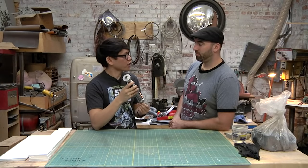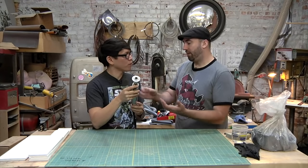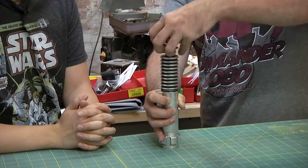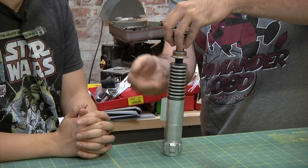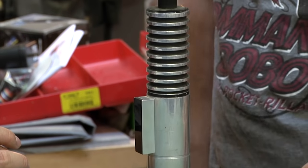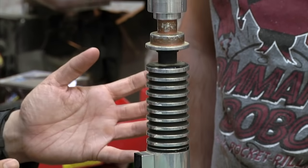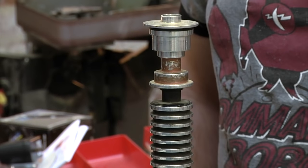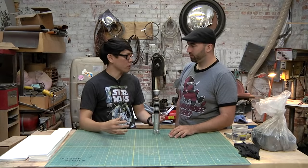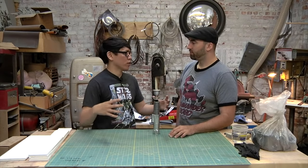Is this the right kind of thing that we want to create a two-part mold for? Yeah, if we were to just glue it down and dump rubber on here, it wouldn't come out of the castings very well because of all these little undercuts and ridges. So it's best to make a two-part mold on this. All right. So I presume, like the other molds, it's going to be some type of silicone, a molding material. And then you also want to create a shell for it.